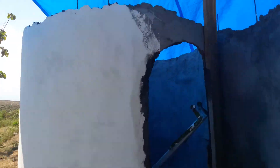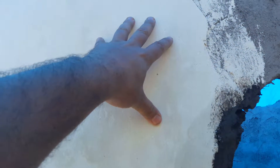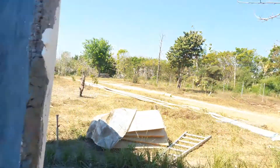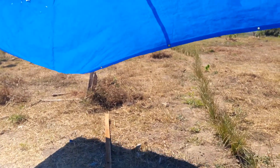Yesterday Amma Agung decided to make a render mix. We were going to mix sand, white cement, and builder's lime in a 1:1:1 ratio, but what he's done is made a mix of one-to-one white cement and builder's lime and applied it. It's actually quite good.